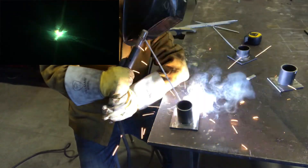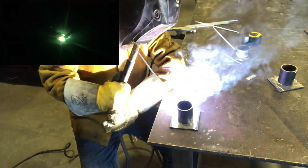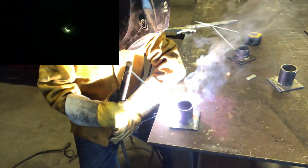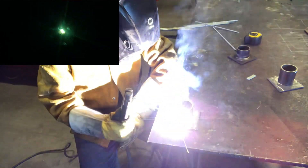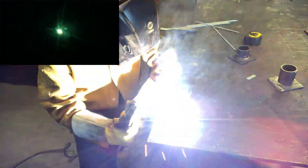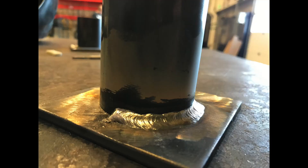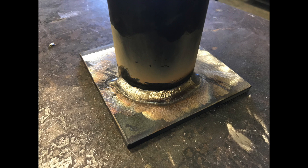I typically would show arc shots, but since you've already seen fillet welds, what I really want you to watch is how I move my arms and hands — slowly rotating to always keep that forward leading angle. When I get to the end, I don't try to push past that point. Here's my completed weld. I'm not totally in love with this one, so I turned up the heat a little bit to about 119 amps — you can see it's a bit rough with some hard corners in that rounded shape.